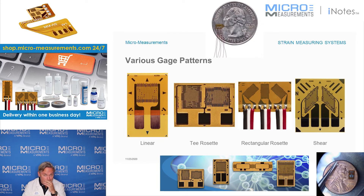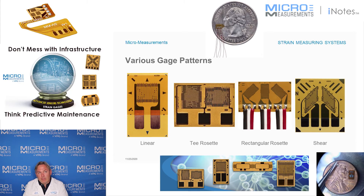The third one is a rectangular rosette. This one has three sensitive grids labeled one, two, and three, and it's important to note the orientation of the grids on the rosette. You would select this type of strain gauge when you're not sure of the direction. With three separate measurements, it allows you to calculate your three unknowns: your maximum and minimum principal strains and direction. It's a very powerful tool for solving an unknown strain field. You still need to get it in the right location, but the orientation doesn't matter because the reference axis ends up being grid number one. It's up to the installer to put grid one in a direction that can be interpreted, but the data calculations don't really depend on it — just get it in the right location.